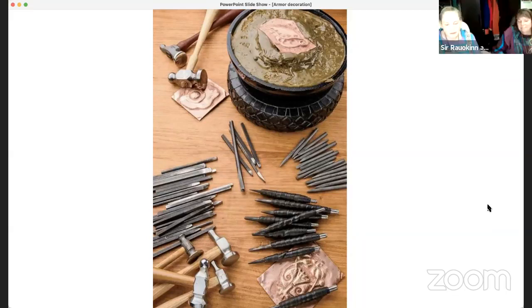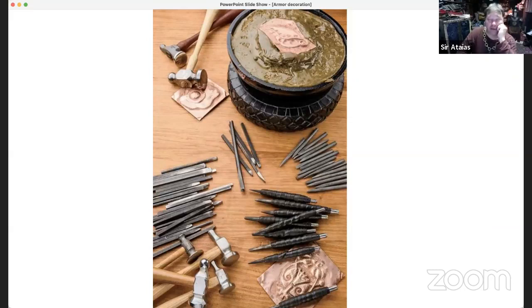Very cool. So Jed put a link in the comments for a good price for pitch and that they have bowls. So you always put your pitch in a bowl? Not always. I mean, the bowl is great. It's designed specifically for the purpose of holding the pitch. It's about the right kind of dish shape, and it's also massive. It's got mass to it. It's not just like your Tupperware bowl or a stainless steel bowl. It has some weight to it, so that helps to keep the work stable and not vibrate or anything like that.